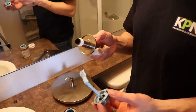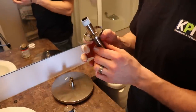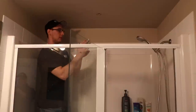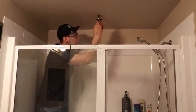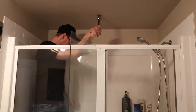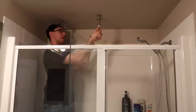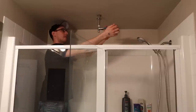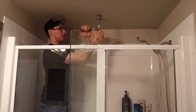Put a little bit of dope only on the one end — the end that is going up into the wall. It just helps ensure we don't have any leaks, because you can't always see those easily. Now we slide this halfway down, look at where the hole is, and put it in kind of hand tight. Then insert the inside pipe wrench — this time we'll turn to the right for tightening — and tighten up the crescent wrench. Always hold onto it so you don't drop it on your acrylic base, or if you have tile you might chip it.